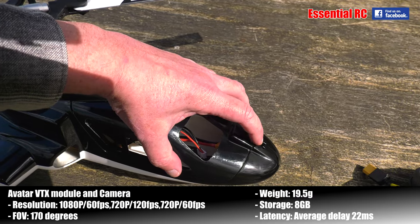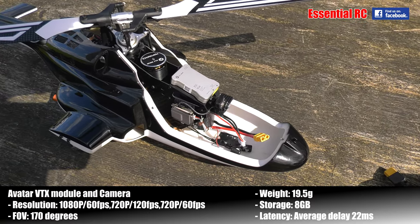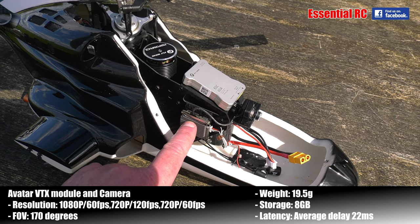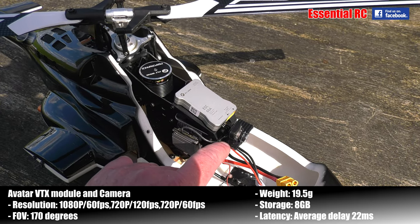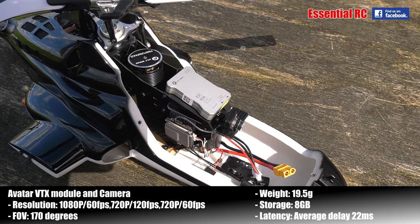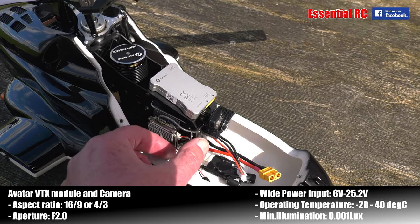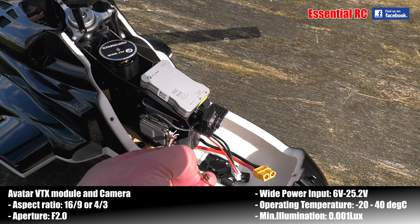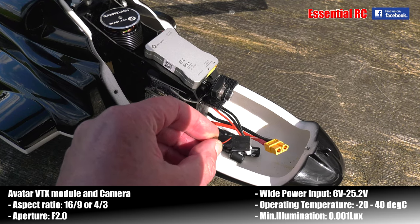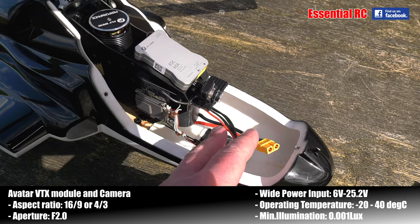Let's take that off and you can see the VTX — the video transmitter — I have velcroed to the side here, and this is the camera. The camera I've just mounted on a bit of velcro on the battery tray tab that you push down and then pull out the battery on the tray. I've got the two aerials here — probably should separate those so they're pointing in different directions — and then out of the video transmitter I put a Dupont connector so I can connect that into the balance lead of the flight battery for the helicopter. Really simple.